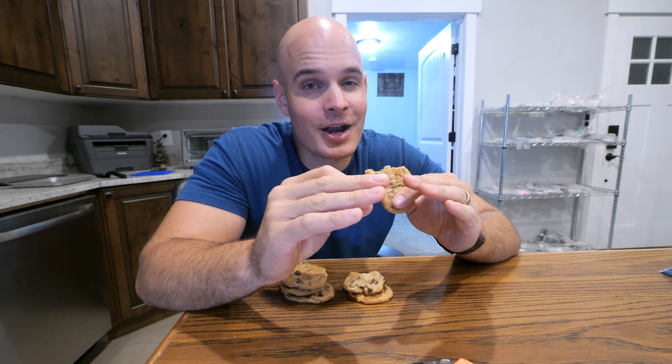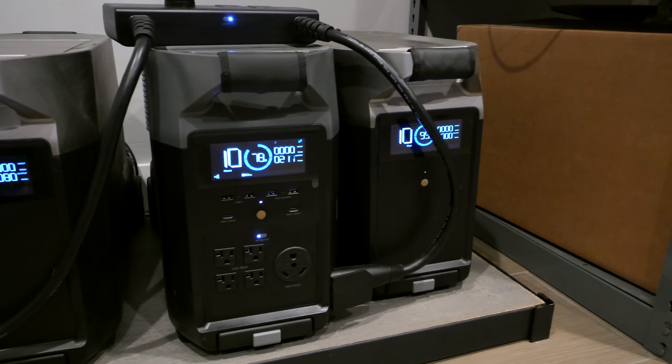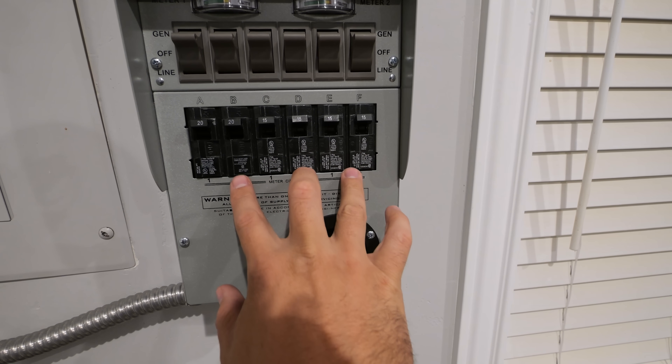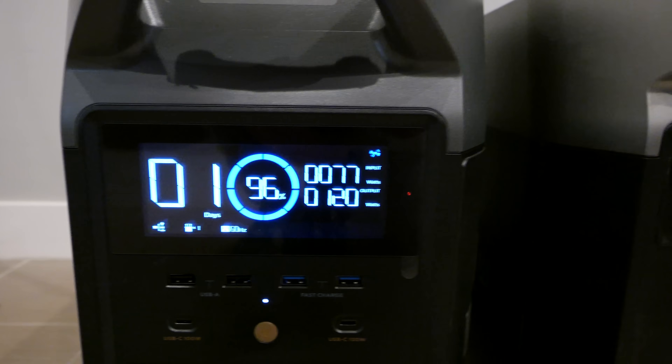Now so far it might seem like all sunshine and roses, but there are a few things that I don't like about this system. The first is that the transfer switch came with a bunch of wires attached and none of them were labeled, so I didn't know which breaker they were going to — that would have been very helpful. The second thing is that the batteries themselves don't balance between each other. It's not a huge deal, but I have to intentionally balance the loads in the panel so they get used up at about the same time. These breakers go to the first battery unit and these three breakers go to the second. The expansion batteries do fill up the battery they're attached to, but one half doesn't balance the other half, and if one half runs out of juice first the whole thing turns off.